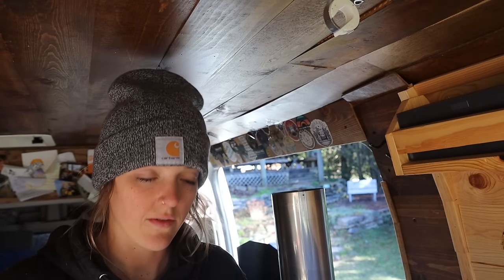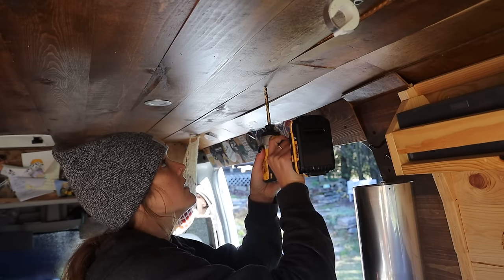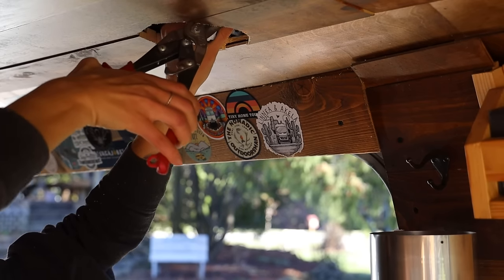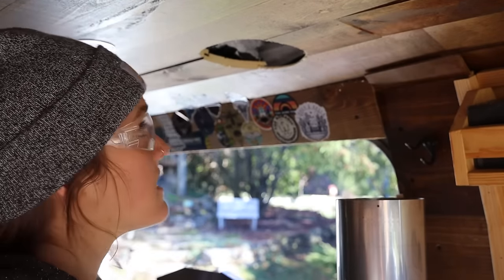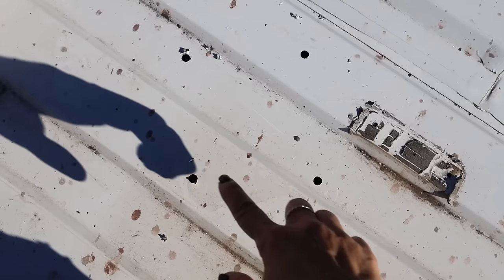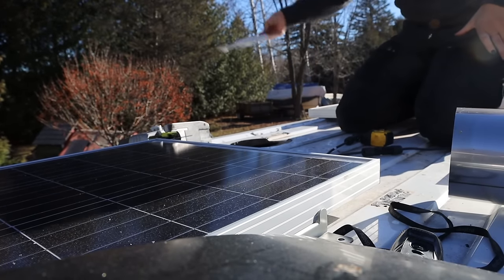There's a lot of things I do with my build or upgrades where I'm like, if I mess up I can recover from it. This is one of those things that I don't think I would be able to recover from if I messed it up. All right, seven-inch hole is complete! It looks huge to me, but it makes sense and they have trim pieces. I drilled holes on the edges of the circle from the bottom so I could create a circle from there. This requires a seven-inch hole so that the five-inch flue pipe has a minimum of one inch clearance on all sides.